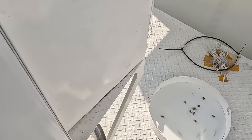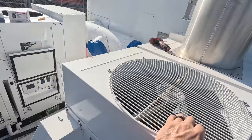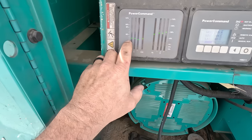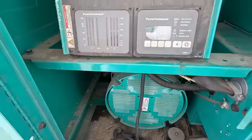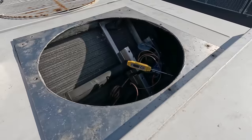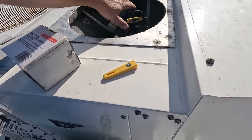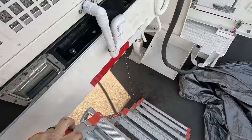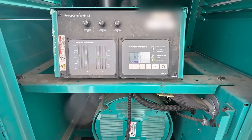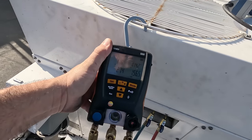Let's see what we're coming in at. We'll set this thing up for maybe a 15 to 18 degree drop and see how that does. We've got both of them running. Let's go back and see what our generator looks like with no reheat on — running right at 44 amps, only about 45% capacity. We can see it's sweating pretty good, so we're removing humidity. Reheat is on, so the temperature came up — 74 and 59, that's 14 degrees right there at that speed. So we're still cooling, just not as efficiently. That trap is doing its job. Running 31 and a half degrees on this one — not doing bad. Running 31 degrees on the other one and 120 on the condensing temperature.